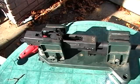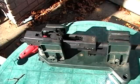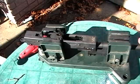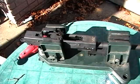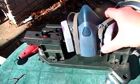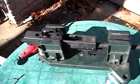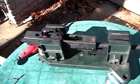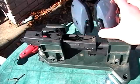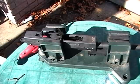Before I begin cutting, I do want to talk briefly about safety equipment. I think it's important, especially when using any power tool, that you're wearing some sort of eye protection — goggles or safety glasses. If I were using an angle grinder, it would probably be a full face mask because of the weight of the disc. For any sort of grinding, I always recommend a respirator as well — even a paper dust mask offers some protection, or a cartridge unit like the one I have. I also recommend hearing protection because of the noise the motor makes as well as the grinding noise on the metal.